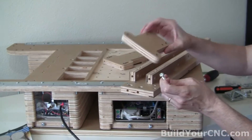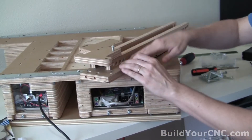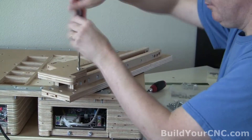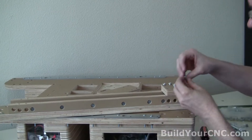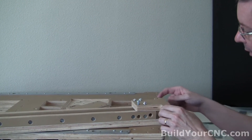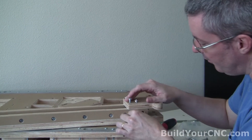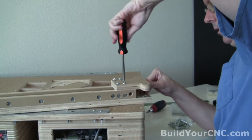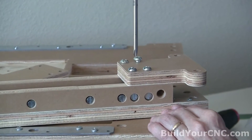I'm going to be using four one-and-a-half-inch screws and four cross dowels for just one side. Note the position of the gantry and the side that I'm putting on the V-groove bearing mounts. There is a tiny bit of wiggle room to make sure that when it's on, all four bearings are touching the rail, so you have a little bit of variation you can adjust. For the beginning I'm just going to press this all the way in so it should be as square as it needs to be. You can also check along the edge to make sure it is straight.